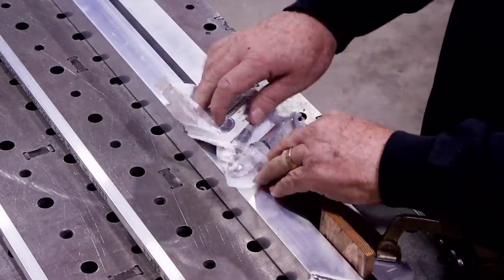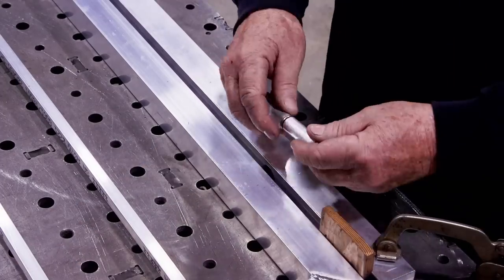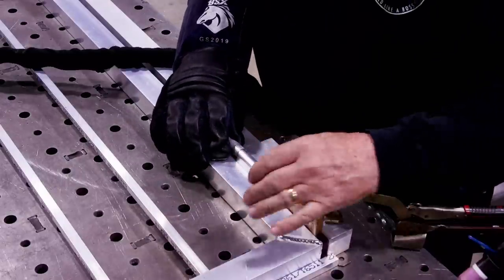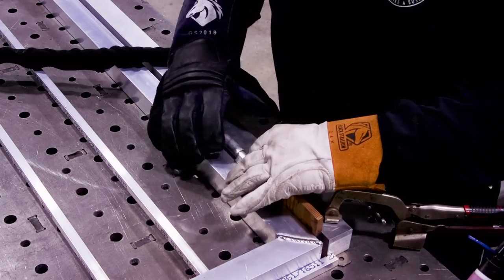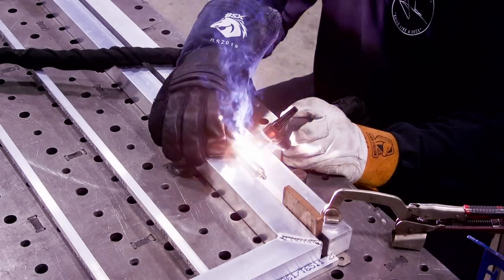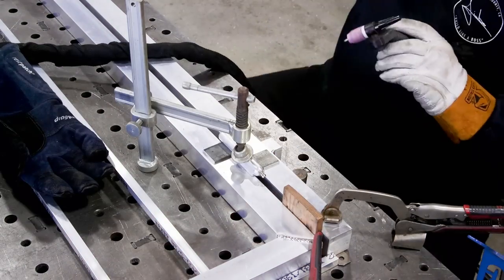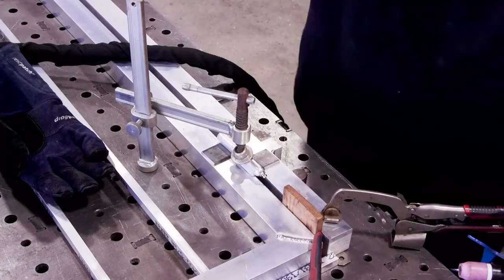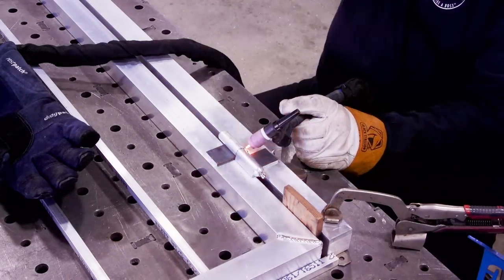Here's what it looks like all welded out — really happy with how it turned out. Now for the bullet hinges — they're aluminum and I've never used these before. With MIG on steel you can hold the hinge in place and tack it easily, but with TIG aluminum you need filler wire, foot pedal, and torch — while it gets super hot. Ended up using small metal spacers to prop the hinge in place enough to get tacks front and back.